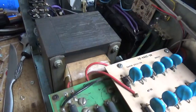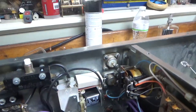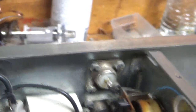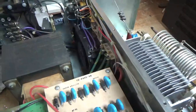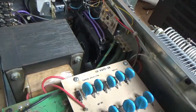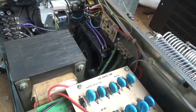I'm going to replace the SO239s that have the old plastic type. I'm going to add gas discharge tubes. I'm going to add a series glitch resistor, series with the plate. Clean the rotary switches. Clean the TR/bias relay. And do whatever else I need to do.